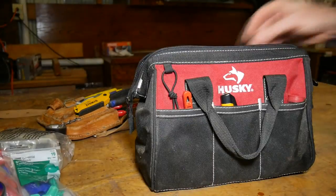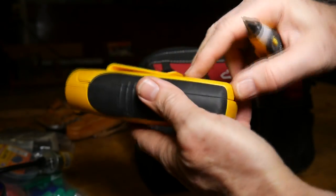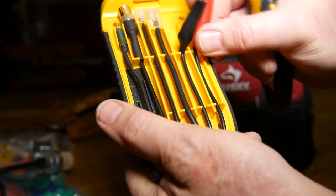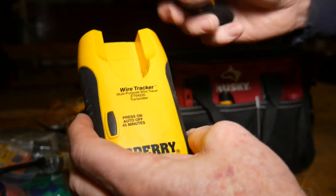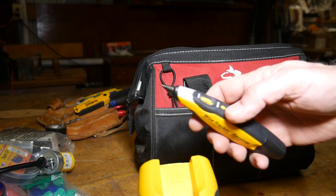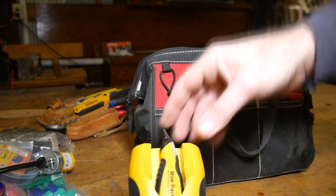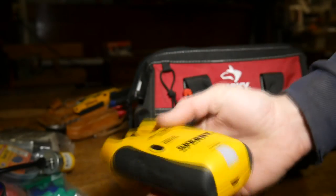Assortment of wire nuts, various sizes, and more electrical tape. Here's something I thought was really going to be handy — this is a Sperry wire tracker. You can connect any of these connectors: a stub connector, a cable connection, phone, RG cable connector, as well as a regular pigtail. You connect this to a non-active wire and it inserts a tracer signal into that line, then you track it with the sensor along the wall to follow where the wiring is. I found it only went for about 10 to 12 feet, but I needed more like 30 to 50 feet, so it just really didn't fill the bill — likely because our walls have drywall plus a half inch of plaster on the ceilings.